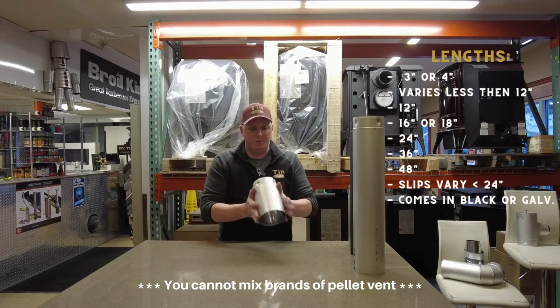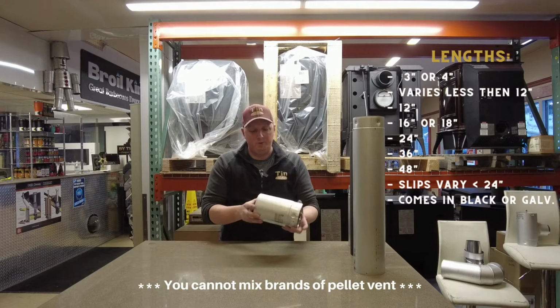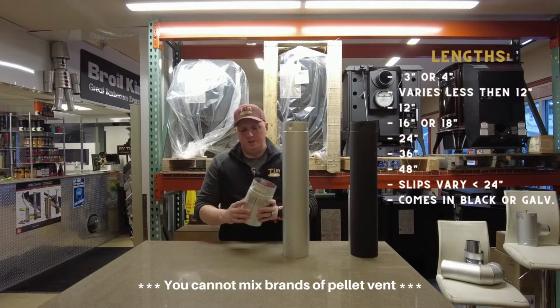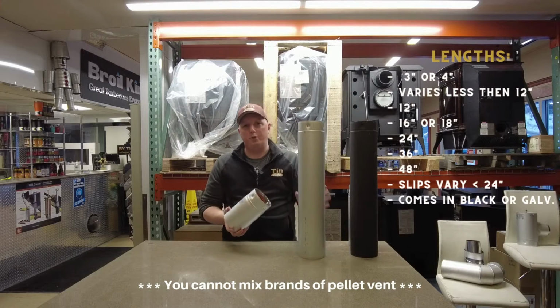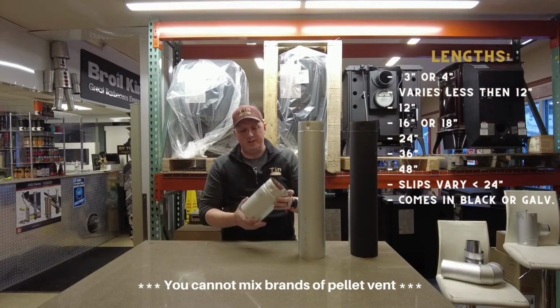The other sections we have, and these are the number one thing that our installers love, are pipes that look just like the other pipes. So here's our regular pipe, and this one is actually a slip joint. What I was talking about earlier, where we didn't have to cut off our pipes, this will actually slip over the end of another pipe and adjust.